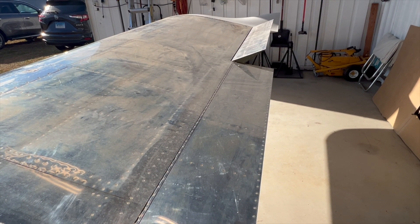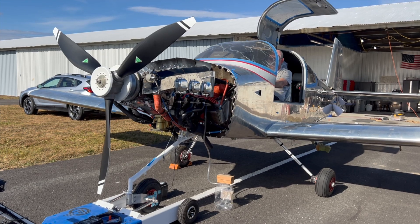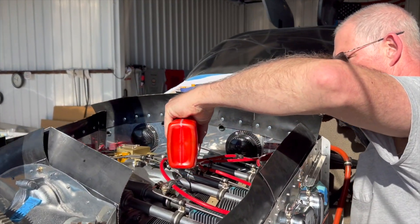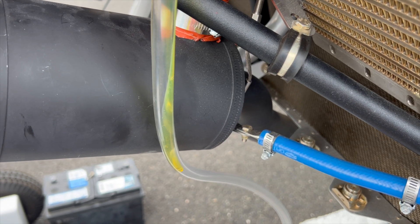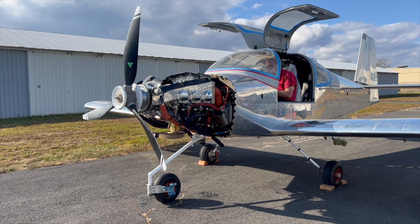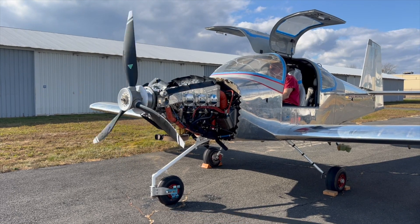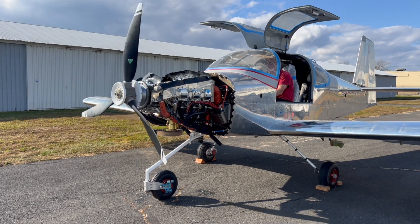Over the last month, the wings, control surfaces, prop, and everything else went on, and they reached a point today where they're ready to start the engine. This morning there were a couple of glitches — Mark had misunderstood which oil to use, so they had to drain it all out, put the right oil in including the oil cooler, and then pre-oil the engine. Pre-oiling means pulling the spark plugs and turning the engine over to get oil through all the systems and verify oil pressure, including filling the line to the oil pressure sensor.